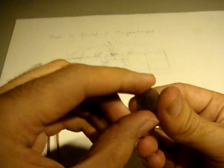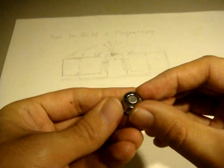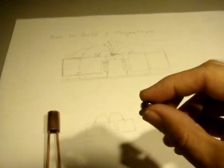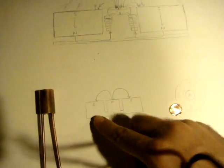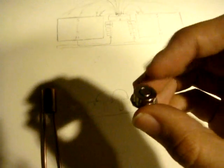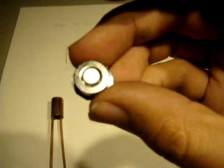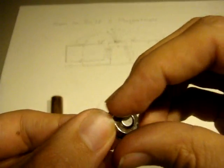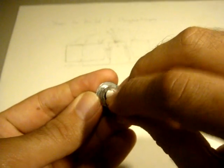I've cut a little piece of galvanized steel to hold them. Similar to the magnetron I demonstrated in another YouTube video, we want to have a south-north-south configuration with the magnets, or a north-south-north. So this ring magnet would be south polarity, and the center magnet would be north polarity.